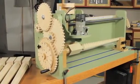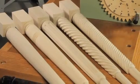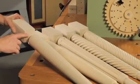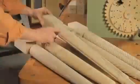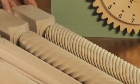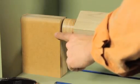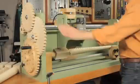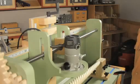The router milling machine from ShopNotes Magazine is a versatile, shop-built jig. It allows you to create table legs and other workpieces with decorative details. These details can be added around any part of the leg along with delicate tapering, straight or spiral flutes, and beads using a variety of router bits. The milling machine starts out as a solid base assembly with a headstock and a tailstock to support the workpiece. Gears at one end of the base rotate the workpiece while simultaneously moving the router along the workpiece.